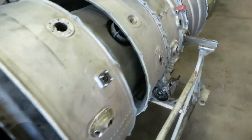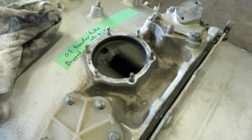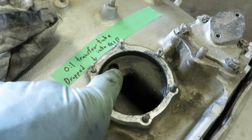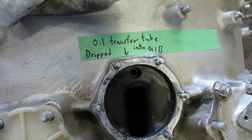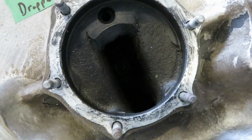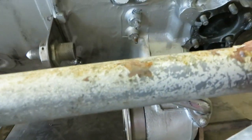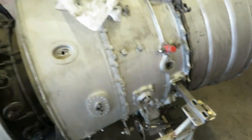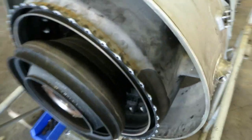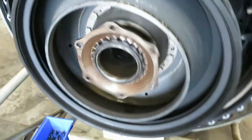The HP system is connected to the gearbox. When I was taking off the LP speed drive, there's an oil transfer tube — about a half-inch long — that was dropped down there and went all the way down through both struts into the gearbox, so it's in there somewhere. It would be a disaster, but this is a junk engine that's never going back together. I'm amazed it hasn't been trapped between some gears; it still allows the HP system to turn just fine.